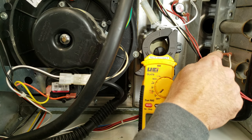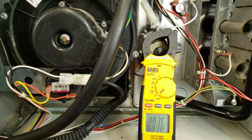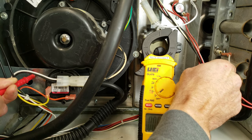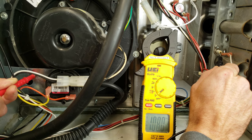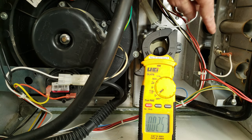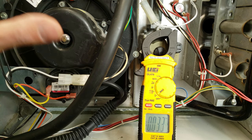Right over here you have your flame sensor. That is powered all the time — it's just testing for a flame all the time. You can check it right here with your ground probe and right over at your rod. We're sending 108 volts right now. You're going to check the flame rectification process when there is a flame, and I have other videos on that in the description section below. Just keep in mind that you never want to touch that flame rod while there's power on the furnace, so make sure the power is off.